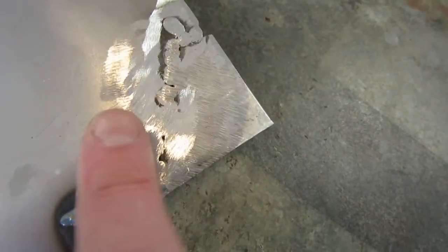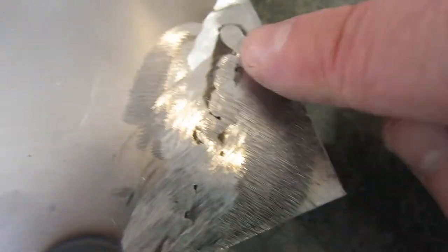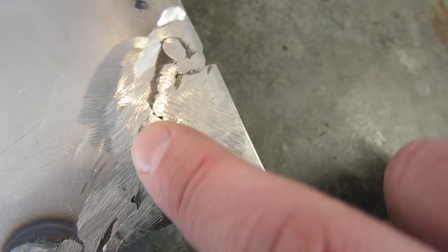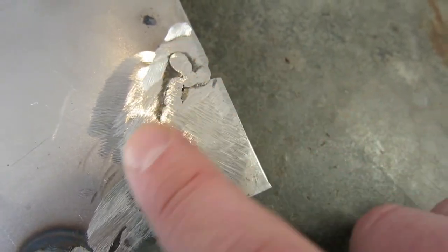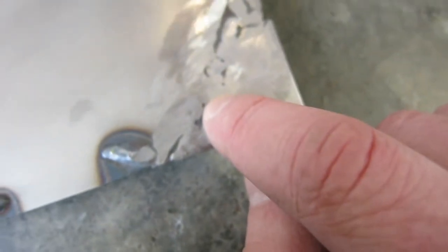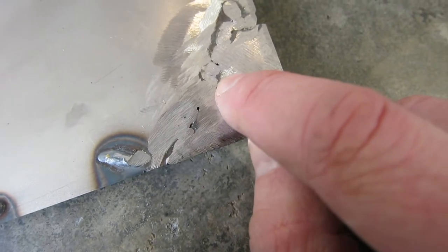Here it is ground down. One thing I'm figuring out is there's a little bit of an art to grinding your welds down too — I'm still trying to determine just how smooth this should be. I'm noticing with some of these welds it almost appears as though there's pitting happening around the weld. I don't know if that's burning or if I'm just not grinding down enough. This is all solid right here — the only holes are a little pinhole right there, and a pinhole right there.